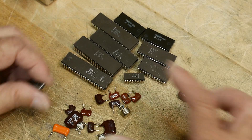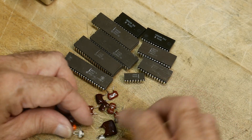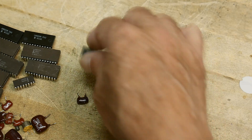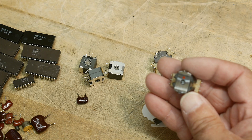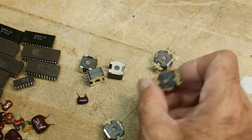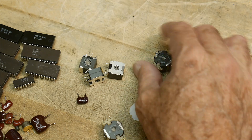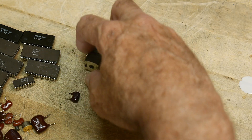I got that one repaired, so now I have a whole complement of parts for a little project if I want to do so. I have a bunch of micas that I saved, and then a bunch of inductor things. These are just inductors, and these are like transformer things. One's a center tap, and one's not. This one looks like a common mode choke, and this one has the center tap on this side — so I think this is an impedance transformer, and then this one again is just a common mode choke.